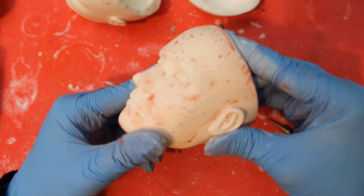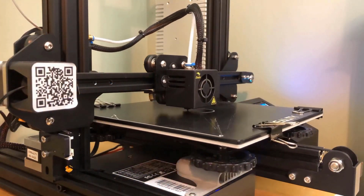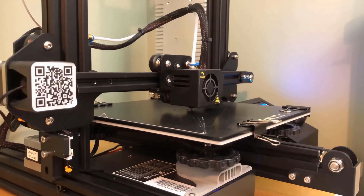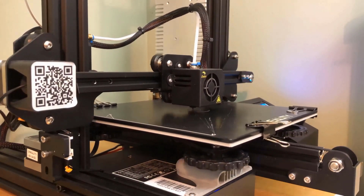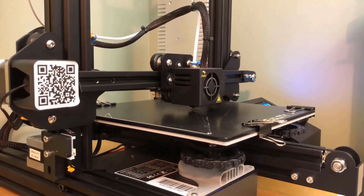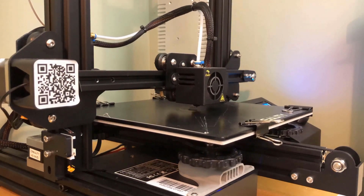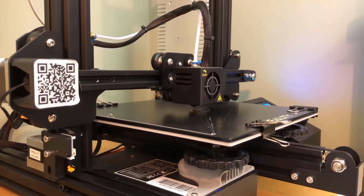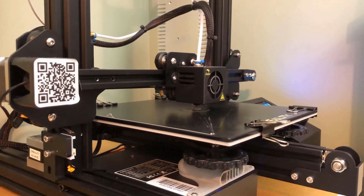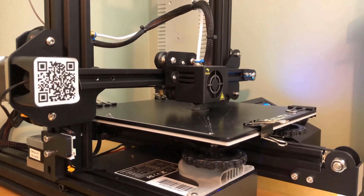So another problem I ran into along the way was I did not account for the fact that my resin casts would be slightly smaller than the original master, and I sculpted the master with 12mm eye wells because Rune uses 12mm eyes. After the mold shrinkage and the resin shrinkage, the cast heads have eye wells that are just small enough that the 12mm eyes will not go in. I'm going to drill them out, but I also found that I was going to need a 12mm eye base that had a smaller iris because his eyes are so small.